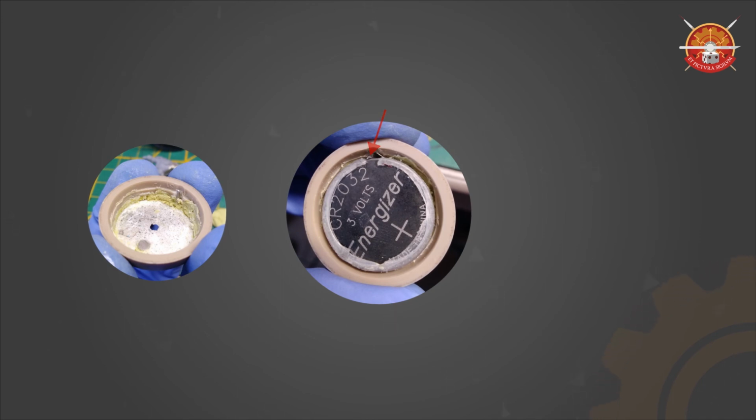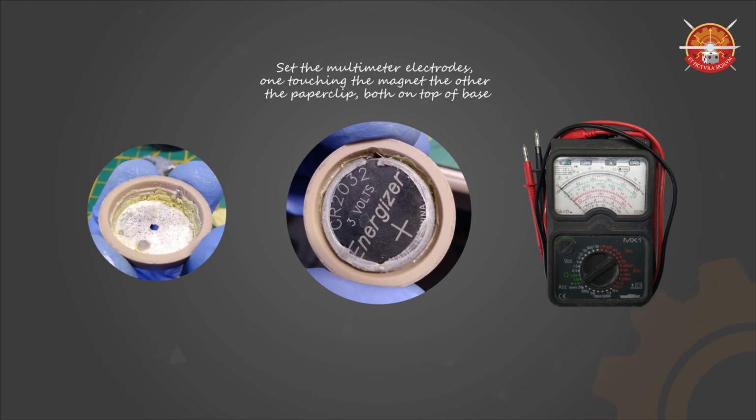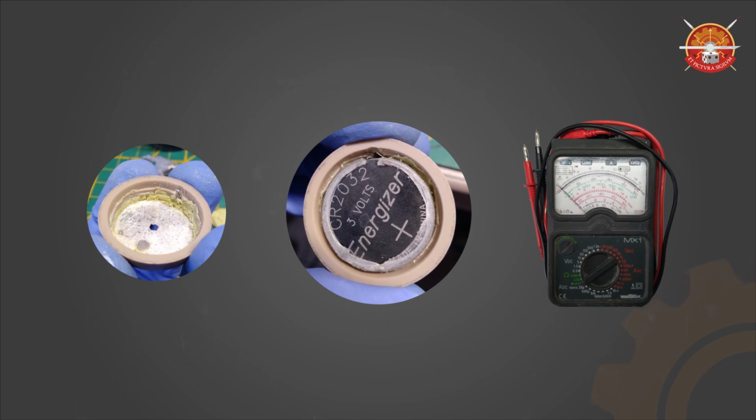On this picture here you can see the paperclip which is sticking to the side of the battery. You can check with the multimeter if the current goes by like it should, so you put one electrode on the magnet on the top of the base and the other one touching the paperclip on the top of the base, and if it's not working you will have to check if everything is touching as it should, and you can add some conductive paint on the magnet inside if you have the necessity to do so.